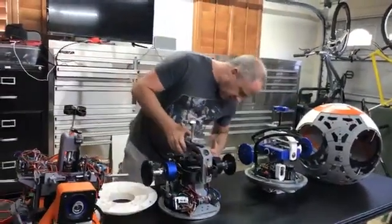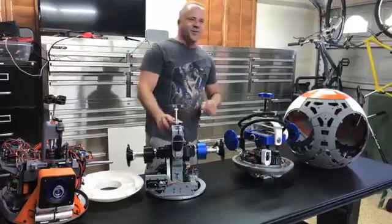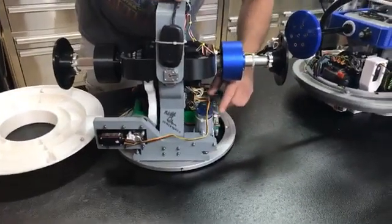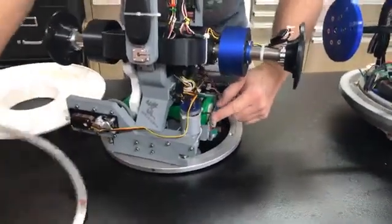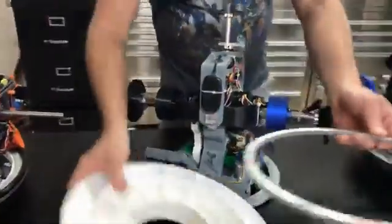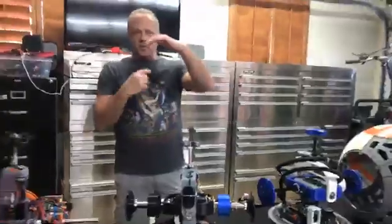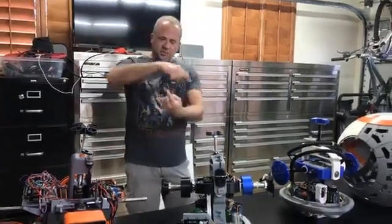On top of that, I'm going to show you on mine — my flywheel spin is here, it should be in the other A-frame on Joe's too. This gear motor here connects to a gear essentially on top. What happens is when you fire this motor up, it spins the weight really quickly. When you spin that weight in one direction, centrifugal force makes the droid want to do the opposite. So that's what allows them to spin on the spot.